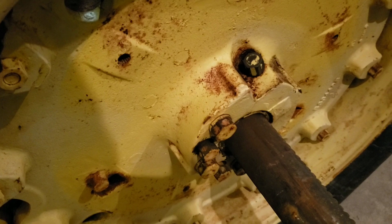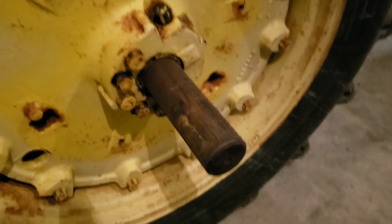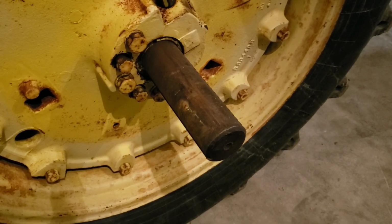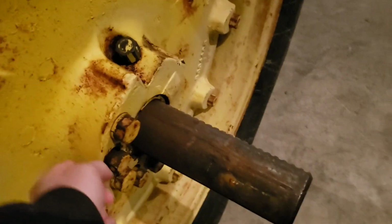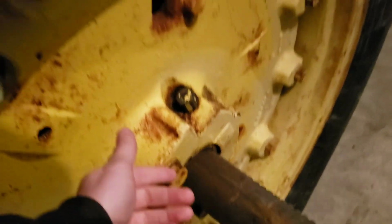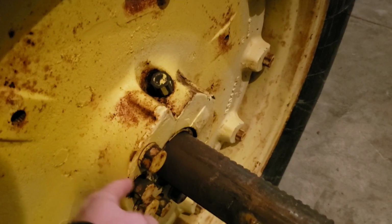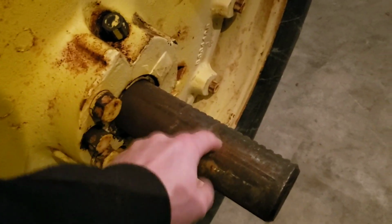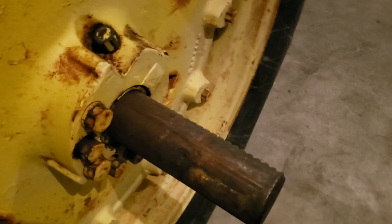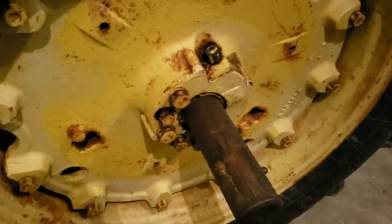And then take your impact, put it back on those pushers, give them some more rattling. Then again, repeat the cycle with blowing the end of the axle maybe 4 or 5 times. That should pop it loose. If it doesn't, go ahead and tap around here. I've seen it where you'll actually start to move this a little bit, but then it just won't quite come loose, which was the instance on that 4630. Tapped around it, actually tapped the top of the axle, medium to light. A little more impacting, a few more dead blows, and the end of the axle came right loose.